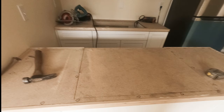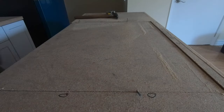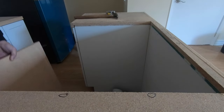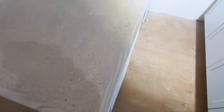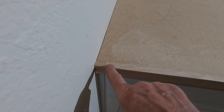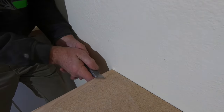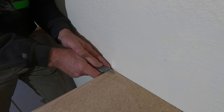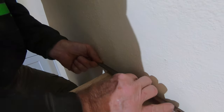Now to cut out for the stove. I usually use my skill saw for the straight cuts and then a jigsaw to finish the corners, and this piece lifts right out. I scraped off the excess glue and hit all of the edges with a belt sander to make them flush and square. I couldn't get right up against the wall and there is still a little bit of material there. This first pass with the utility knife shows me that the grain is running downward there, so if I try to take too much, it'll rip a big chunk out. I'll stop and cut back from the other direction and finish it off with a file.